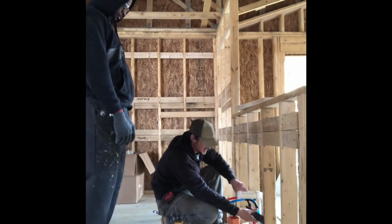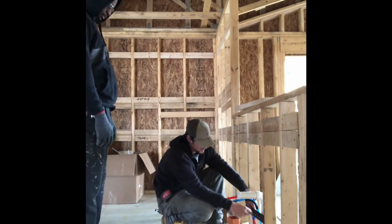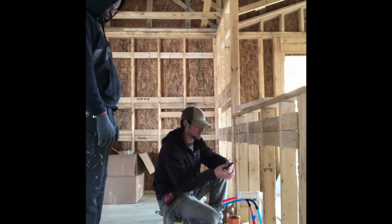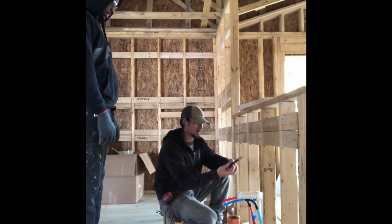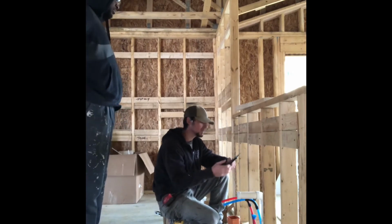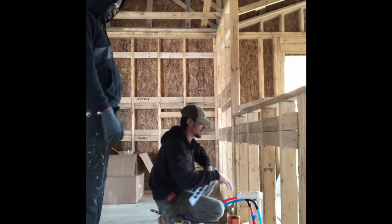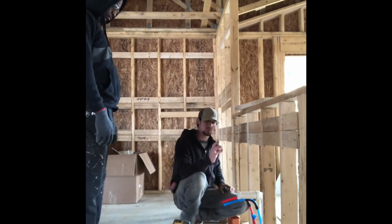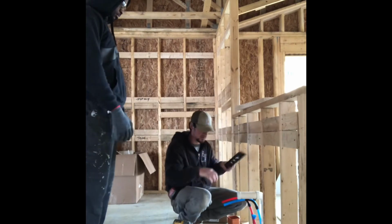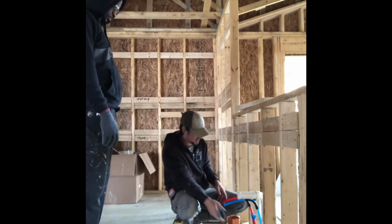So this one is going to be easiest if we put this one in here and this one in here. You never want to put them next to each other. Okay, so at least two apart? Yeah, you want at least one of whatever you're doing between. Just because when they're in the cabinet, we'll put what's called escutcheons on, the little white covers. I know what those are. Yeah. That way you don't want them touching and hitting. You want it to look nice.